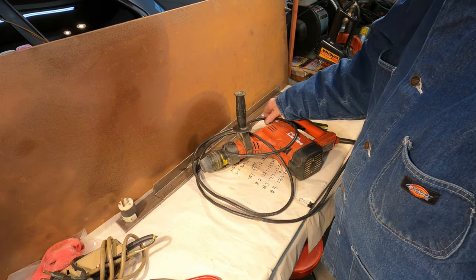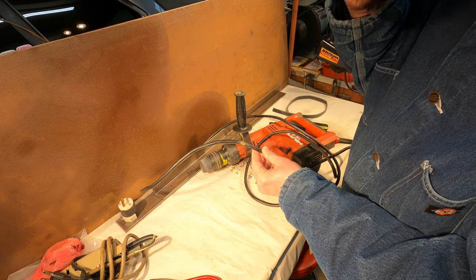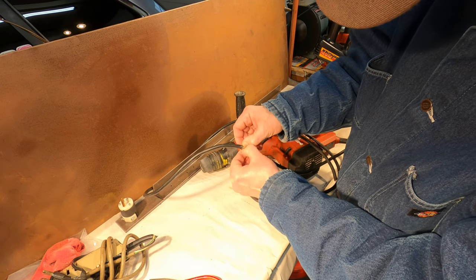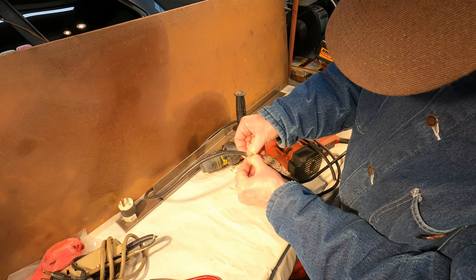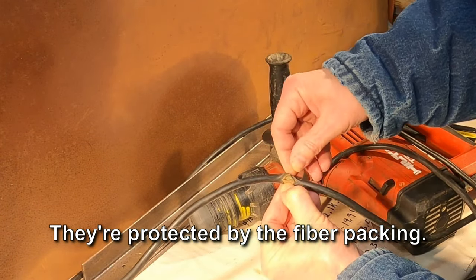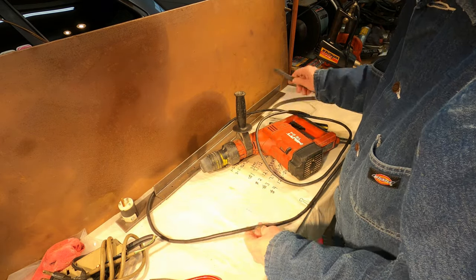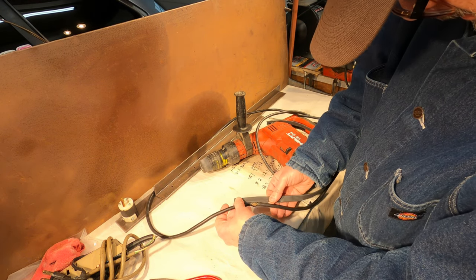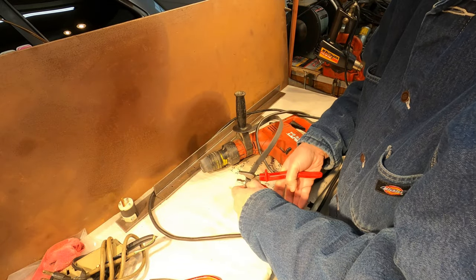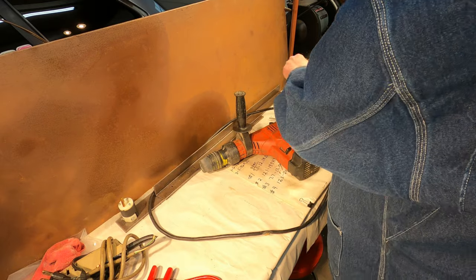So let's get to it. When I was reviewing all my drills I found some problems with this one — this cord has a damaged spot on it. I was able to peel back the paper packing in there and I can see that the insulation on the conductors wasn't damaged. They weren't even touched. Can you see the green wire there? I don't want to open that up any more than it already is because I'm going to close it up. I'm going to put a piece of shrink tubing on it, maybe three inches long to start with. If I can get another layer of the same size tubing over the first layer, I'll do that also so it'll have two layers on it.